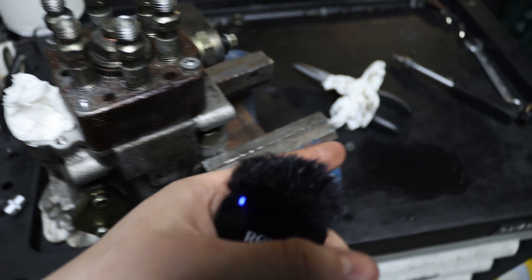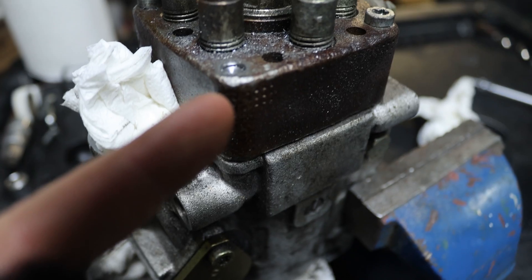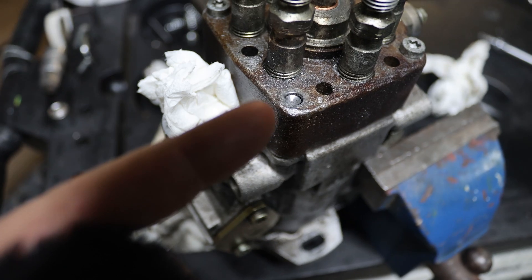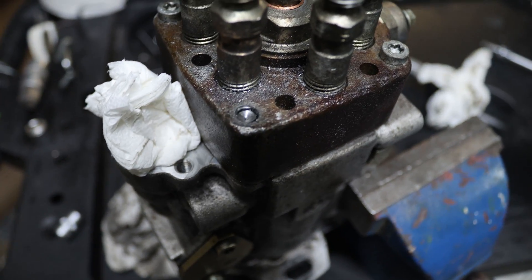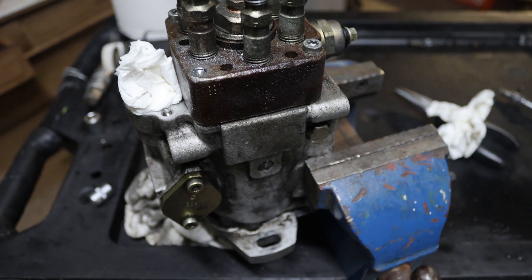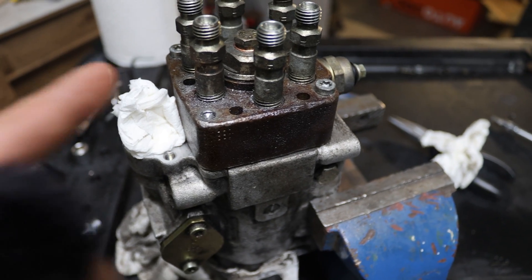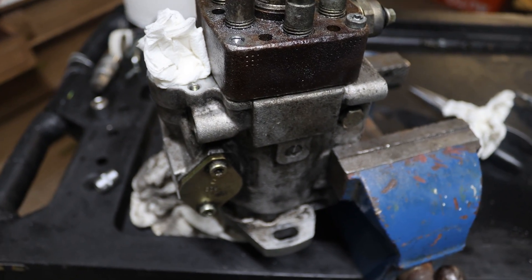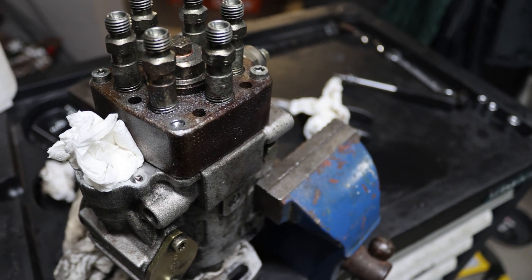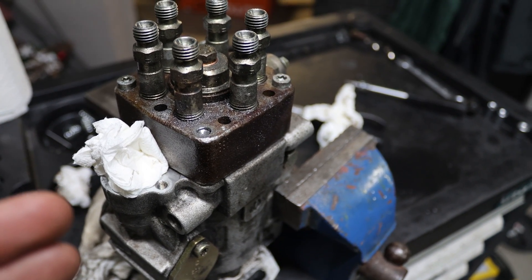So I took a drill to it. This is what's left of the bolt. The height difference you can see — all the other bolts are still fully torqued down, and these bolts were stretched a quarter of a millimetre or so — they were way too tight. I think that was a professional shop that did this, because there were markings on them with black or yellow paint. I literally think somebody took this to a Bosch service or a regular mechanic and they torqued it down so hard that it would never come undone.